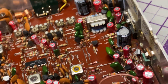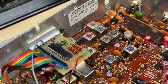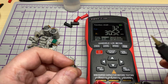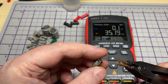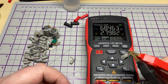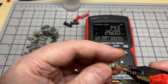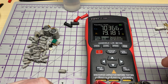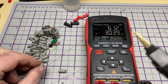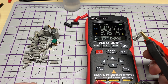I normally don't do recaps, but I wanted to try it again to see if there are any faulty capacitors. I've tested all the capacitors and found only two that are out of tolerance. There's a 100 mic 10-volt cap - you can see it's low but it still works, though it's well out. And there's a 4.7 mic there that's gone high. We all know these 10-volt caps like to short for the fun of it. So there is method in doing the recap, and there's also method to leaving it.